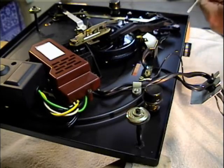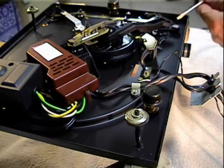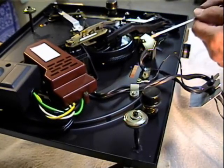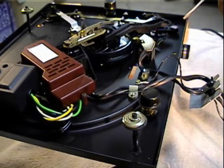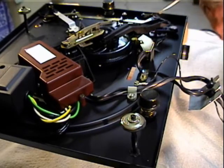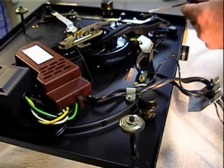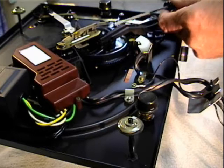The Steuerpimpel would be located here, right under the main lever plate. The main lever, this, is attached in a bracket, and the bracket attaches in one of three ways that I have seen. It clips on, which is true with the 1257, or it has a hook in it right here, and the main lever slides in this direction down and then back toward the motor and then lifts up.